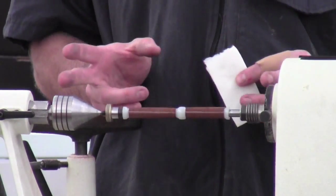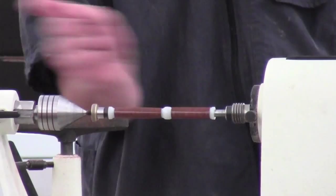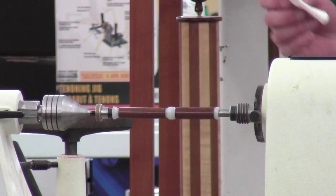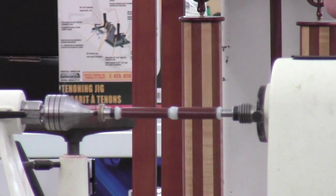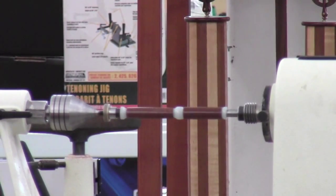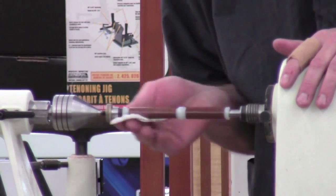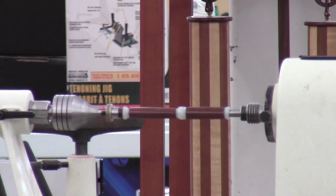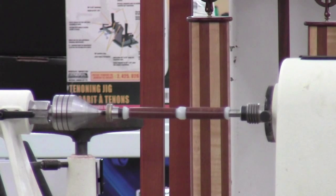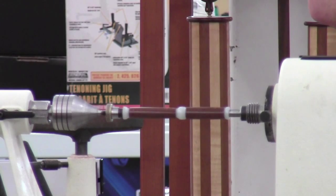I can do small pepper mills with CA now. As long as you put it on there, you smooth it around really quickly, then come in with your accelerator, it's dry, put on another coat. You can keep doing this. I'm already at 3 coats, which normally I wouldn't have even thought about starting the second one yet. Any questions so far? Exciting stuff. We're moving now.